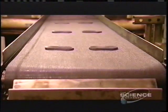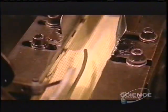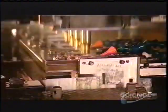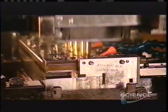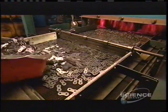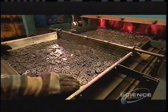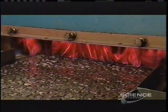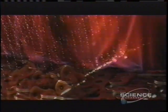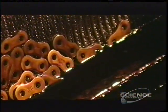The plates travel on a series of conveyors. An arm positions them as they head towards the next punch press that makes two holes in each link plate. A worker then pours them onto a tray and spreads them evenly across it. A vibratory mechanism shuffles them into a blazing furnace. This heat treatment toughens the steel.